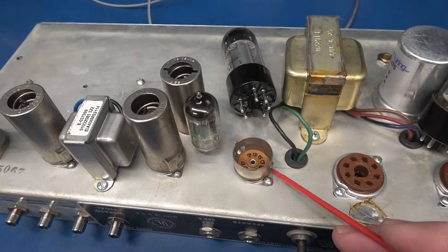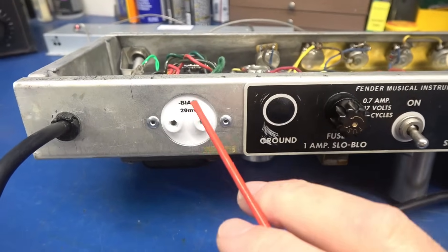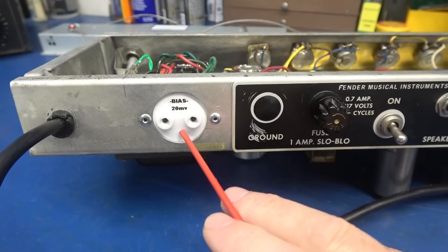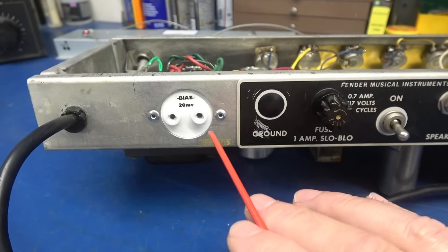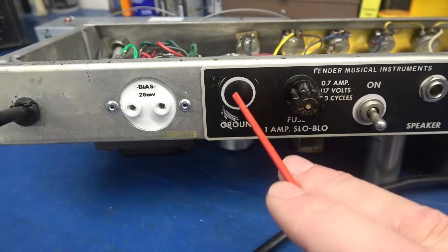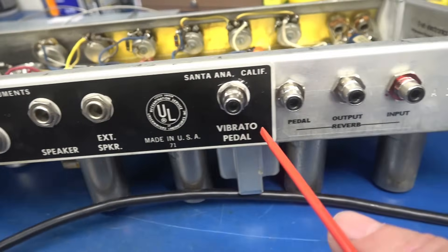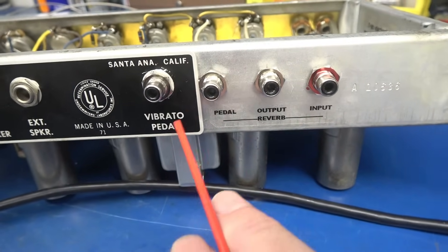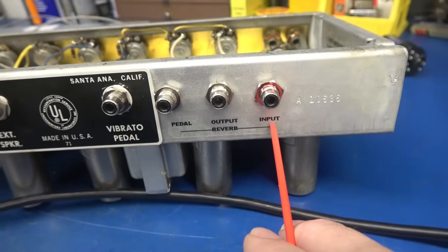Over here I have the 9-pin socket with the Elco shields. On the backside of the amp, where the AC outlet socket usually resides, I installed a plate and added pin jacks so you can monitor the bias on the two output tubes — this allows you to adjust bias without pulling the chassis. The ground switch has been eliminated and capped. Everything else is original, and then we have the three added RCA jacks for the reverb function. The vibrato pedal was not interrupted. This is the reverb pedal — output and input for the tank.